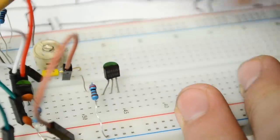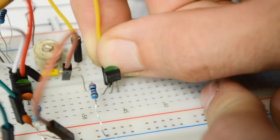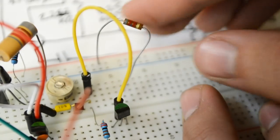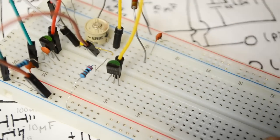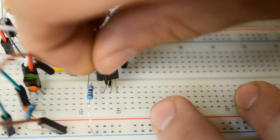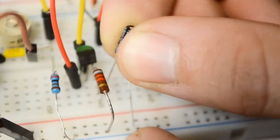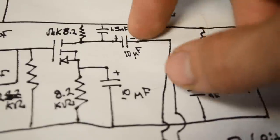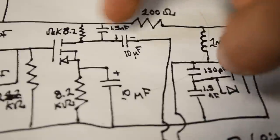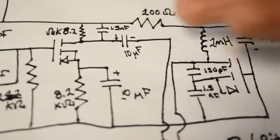I'll connect up the variable capacitor to the secondary side of the inductor, with the other side going to the ground rail. Next I'll connect a 3.3 picofarad capacitor from the secondary side of the inductor to an open rail, followed by a 2.2 kilohm resistor from that open rail to ground. Now we're centered around the middle JFET — I'll use the same trick of placing it on the rail below and connecting with jumper wires. I can immediately take a jumper wire from the 3.3 picofarad capacitor rail to the gate of this JFET.